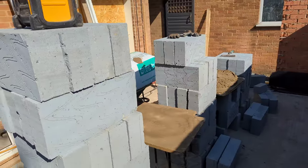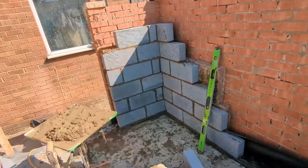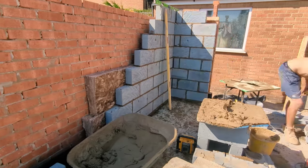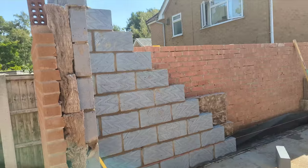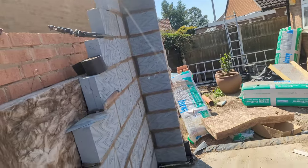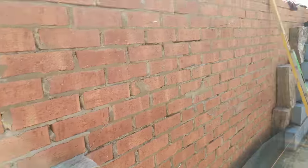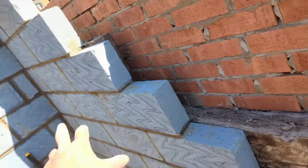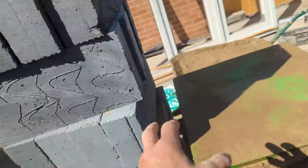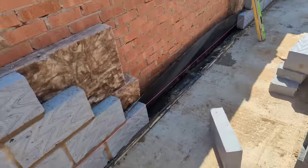We've got one full barrel left and I've got one in the mixer. Key is when you're working on your own — always stay organised. So this is how we are currently looking: we've got a corner here up 10 courses, and a corner there up nine courses, pretty much ready for lintel. I don't normally build massive corners like this, however on such a hot day I didn't want small corners with my compo slowly going off. I'd rather work consistently using just two spots, so we are going to blast this up now.